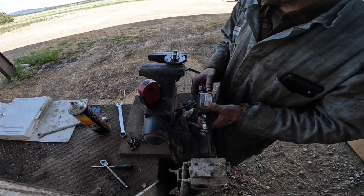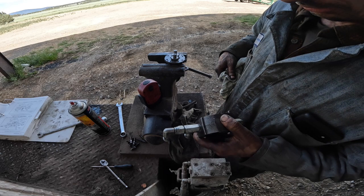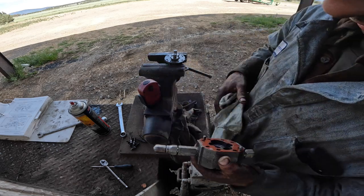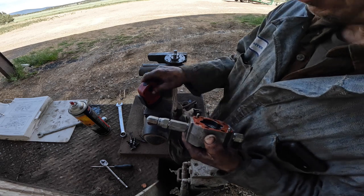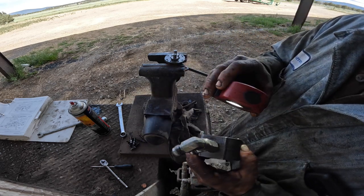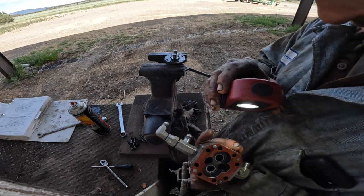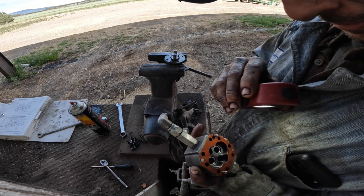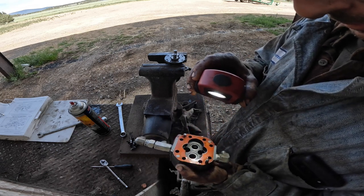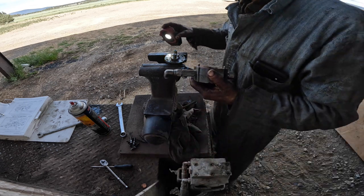Remanufacturing East. Fuck me, man. I bet it doesn't take much on one of these gear pumps. There's scratches in here, man, up inside here, and on a fuel gear pump, it don't hardly take anything to make those go to shit and not build pressure. I bet that pump is junk, remanufactured piece of shit pump.